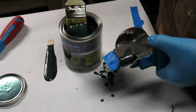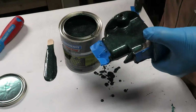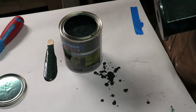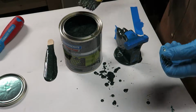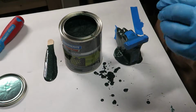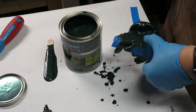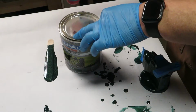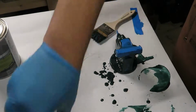It's still kind of difficult to get it in a can, and a lot of companies will offer hammered metal paint, but Hammerite is kind of the standard for this kind of stuff because it's not just a paint. It also stops rust. It's kind of a rust converter and a rust cap. So if something does have some residual rust after you start doing the resto, the Hammerite paint will actually stop the rust from spreading and seal it so that you don't get any more of it.